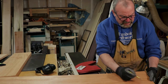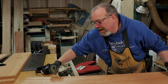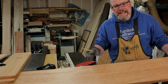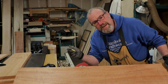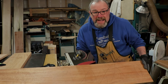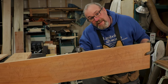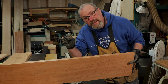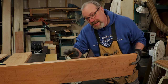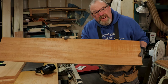Did you hear that? It missed the whole section right here — so I'm going to mark it and hit it again. This whole section is way up in the air. I had to bump at it and it didn't want to go any further. Don't force it — just back it out carefully. This is very thick, about seven-eighths. The final dimension is three-quarters of an inch thick. So if I get it down to thirteen-sixteenths, I can take a couple passes, flatten it out at thirteen-sixteenths, then run it through the planer at three-quarter, and I'm good.